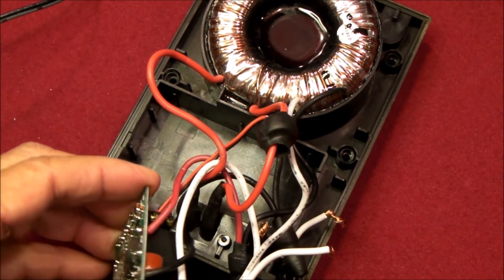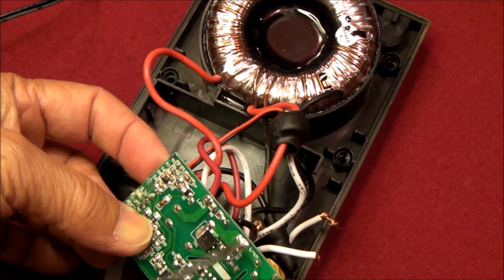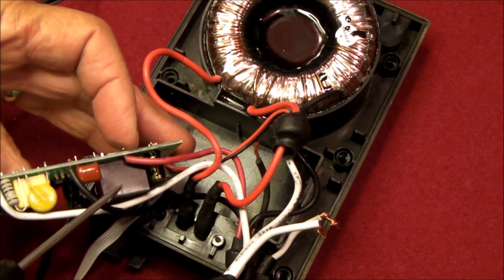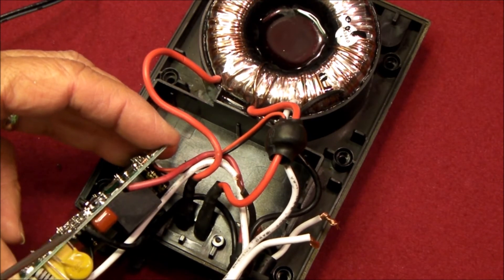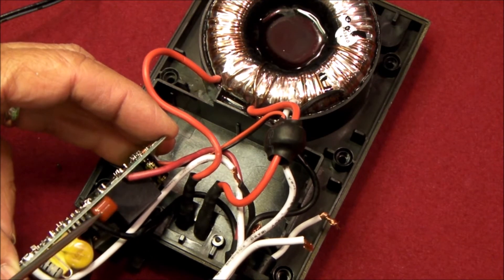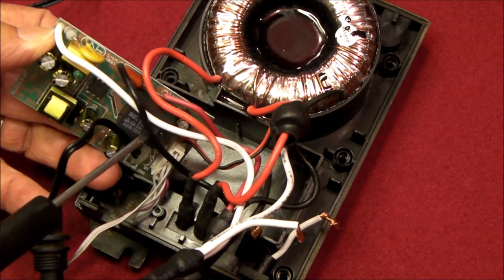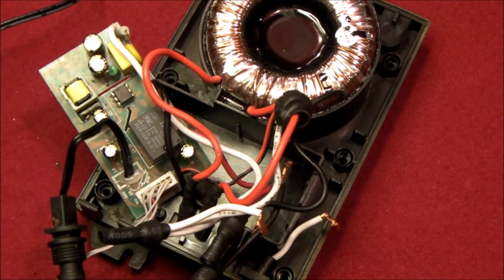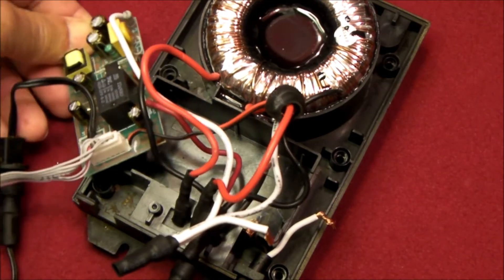The other thing you could do is just leave everything. Based on reading the board, this says 'L in, L out' — so that's line in, line out, and it's controlled by this relay right here. So you could bypass all the electronics by simply unsoldering the black wire and unsoldering this red wire and connecting them together. That way you've totally bypassed the control relay. So regardless of what it's being told to do, since the smarts and brains are not working — the photo sensor, timers, and everything else — you'll still be able to get this working.